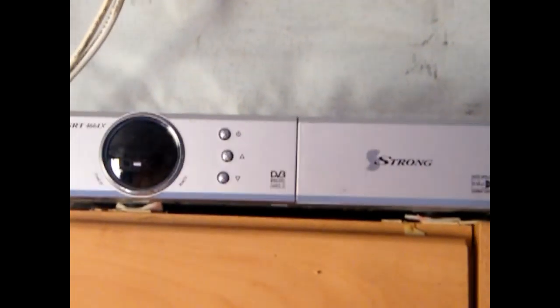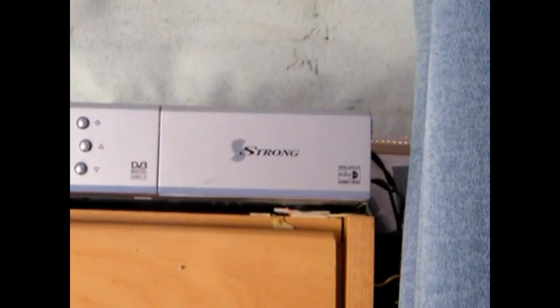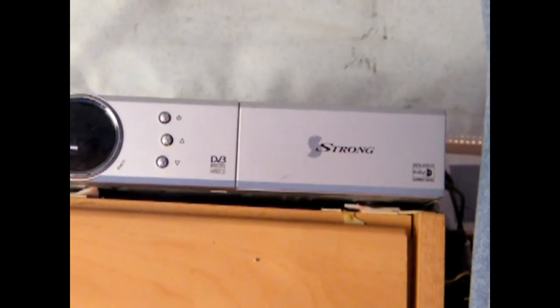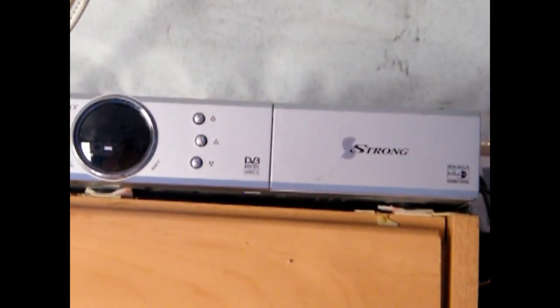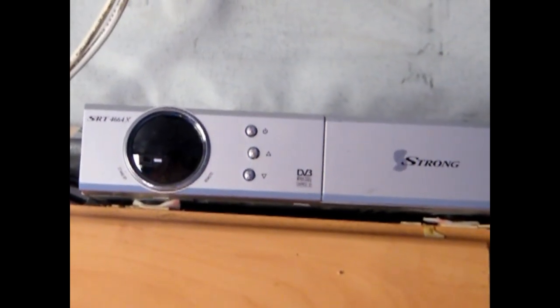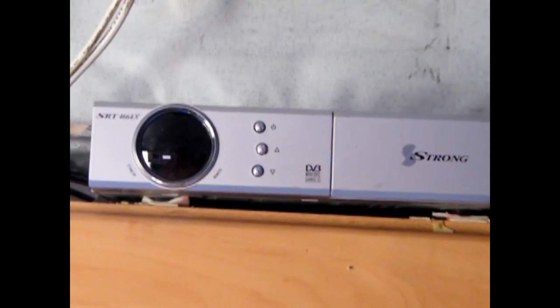Here's the satellite plate on the inside of the van. It comes up to the satellite box — I've got the box turned off at the moment — and it goes to the LNB input. The cable goes to the back of the satellite box, and the output of the satellite box has the three AV cables — the red, yellow, and white — and they go to your TV, to the AV input of the TV.